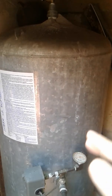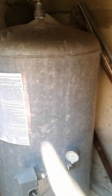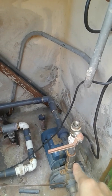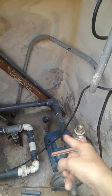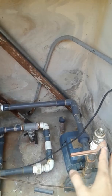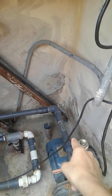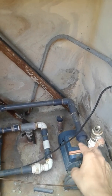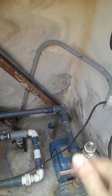So when there is a building that has 3 floors or more, I think 2 floors or more, but sometimes it's 3, you must have a water tank and a pump. And here's the deal. If the water pump is on, but there is no water coming towards it, the pump will be running, and then it will actually explode if suddenly water comes in, because of the heat. This thing will be overheating, and the temperature will be quite high. And then if all of a sudden water comes in, boom, it will explode. I have seen that happen in at least 3 buildings in my city.